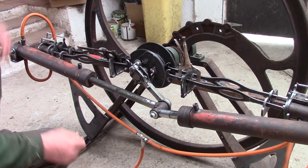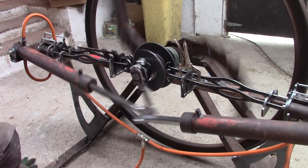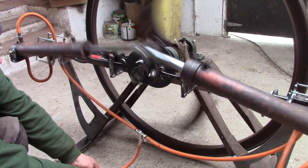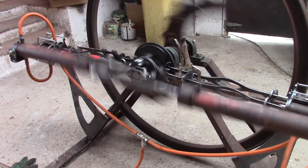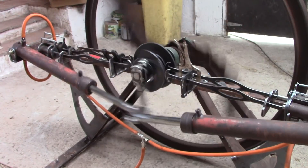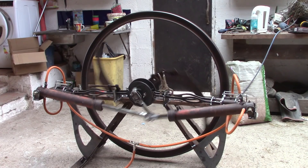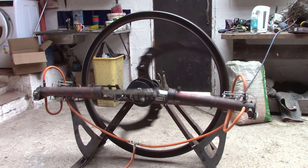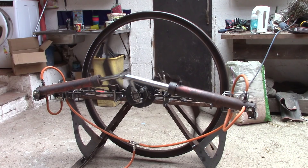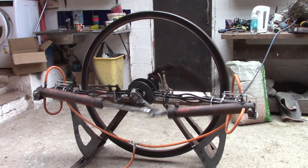The two unpowered parts of each rotation mean that sometimes it won't start by itself, so I need to give it a little push. The question is whether it has enough power to do anything useful yet. If geared down to an eight-inch wheel it would surely go along on a level track, but could it pull anything? I could open up the ports to let more air in and out, which would help with speed and power, but then I'd need more air or steam and a beefed-up frame. Also, at the moment the engine only goes in one direction, so I need to figure out reversing.